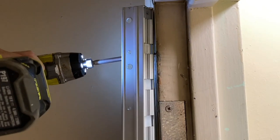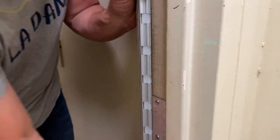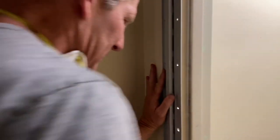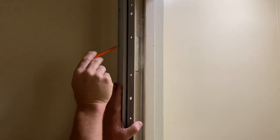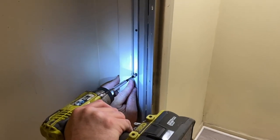Now that the hole's in there, I'm going to put the first screw in. With the first screw in, you don't have to check if this thing is perfectly plumb — it's forgiving and moves around a little bit — but you want to make sure it's lined up with the jamb. I just eye it up; everything looks pretty good. Now that I know this is where I want it, I'm going to leave that screw in and mark the rest of these holes. I don't want to risk getting paint, dust, or metal in this gear, so I'm going to take this off, pre-drill all of these, then put my screws back in.